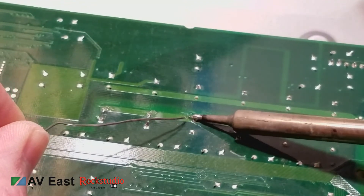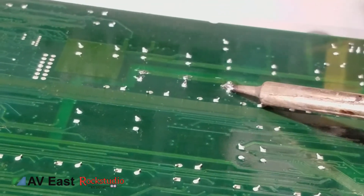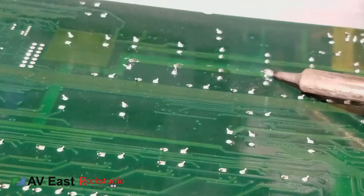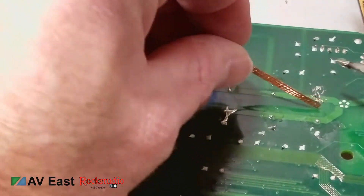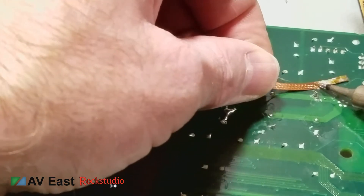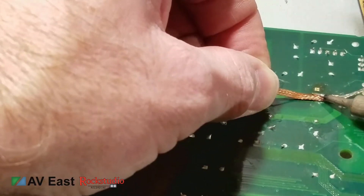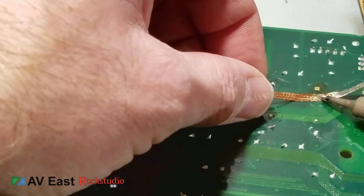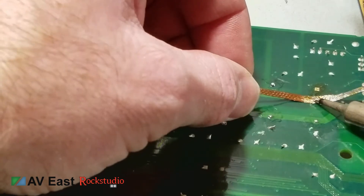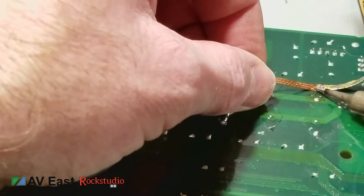You're going to start to heat up and loosen the solder on those big power supply caps. The solder that was used when this product was made is most likely lead-free, which makes it tricky and more difficult to melt. To help, just add a little normal solder. The easiest way to get those caps off is to heat one leg from the back with the soldering iron while keeping your finger on the other side, and as soon as it melts you can bend it out of the way, then do the same for the other leg. This next part is critical: you have to remove all the solder from the through holes for those old capacitors — if you don't, you won't be able to fit the legs of the new capacitors through. Use some solder wick. Put a little bit of solder on the tip of your iron, hold it down onto the solder wick, and eventually it will heat up enough to melt the solder on the board and wick it up into that copper braid via capillary action. You've got to be patient and keep at this process — eventually you'll see the holes open right up.